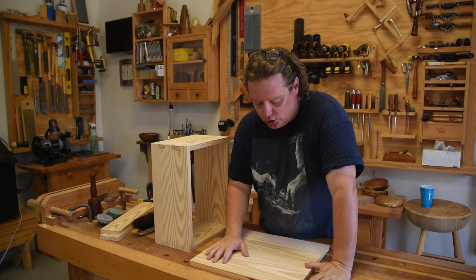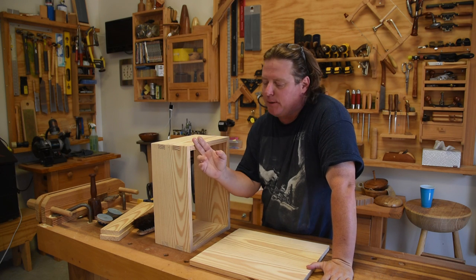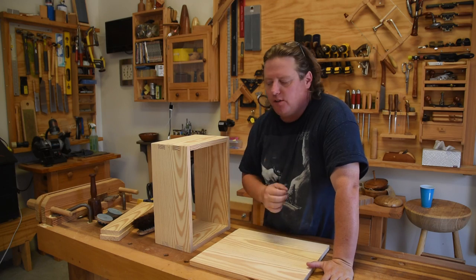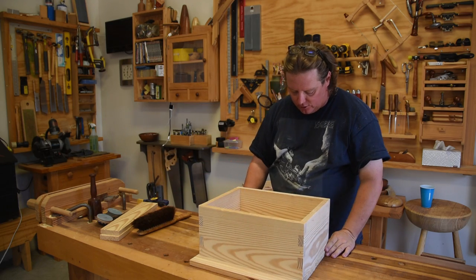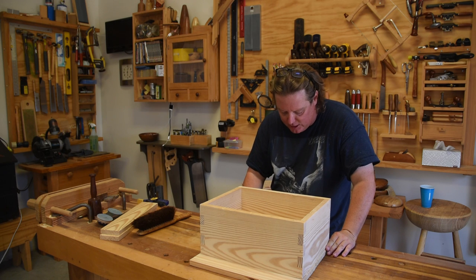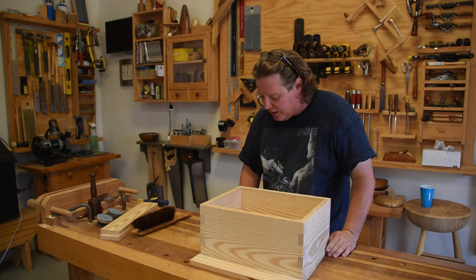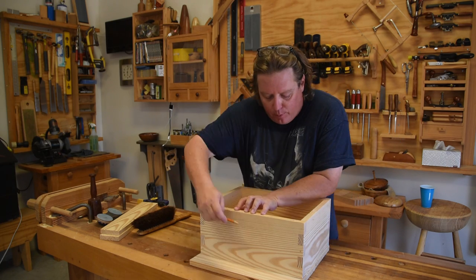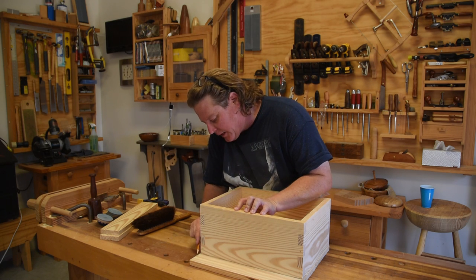So next up, we're going to saw out a rabbet out of our base. So we'll slide up in here and won't give us as big a reveal. It'll be nice and flush for a nice clean look. To do that, we first have to figure out how much of this we need to cut off. So the easiest way I know to do it is just take measurements directly off of the piece. So I am just going to line up one side on this side, bring my pencil, and this is going to be my cut.